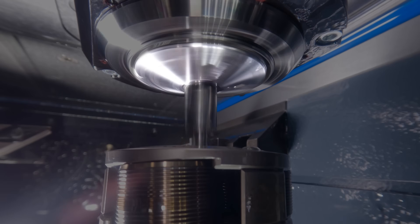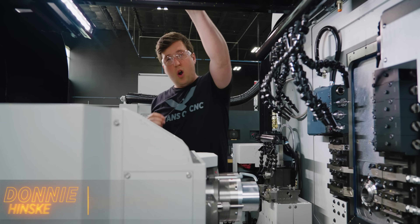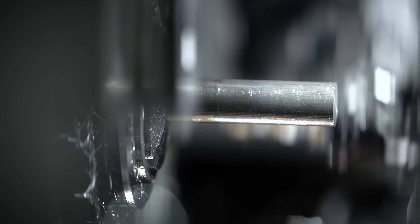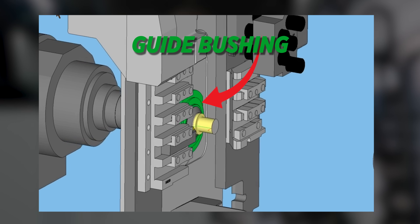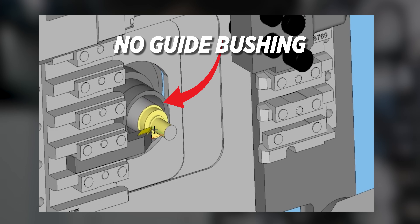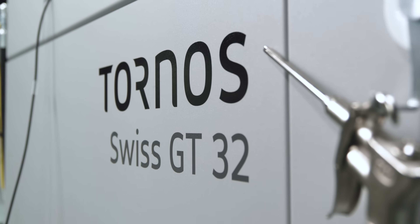Now if you watched my thread rolling video, you might have noticed that I switched from guide bushing to non-guide bushing mode. For those of you who don't know what that means, let me show you. Normally when you're watching these Swiss machines run, you're watching the material move through the guide bushing. The guide bushing is just what it's called — it's a bushing that guides the material. It doesn't open and close, but it's set to a snug fit for the material to fit through. This is great for rigidity, but the problem is if your material varies or is wildly oversized, it's going to jam up, which leads to breaking all your tools.